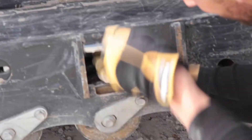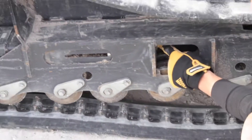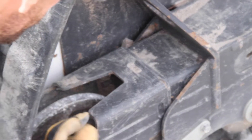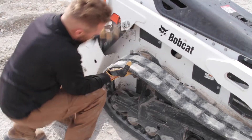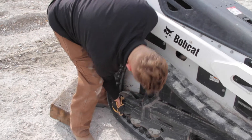To tighten, you go down; to loosen, you're going up. So we've loosened our tensioner all the way up using our inch and a half. This is your idler. See how this is nice and loose? It goes in and out and now we've got a lot of play with the track. I didn't have to use the pry bar after all because it's so loose right there.